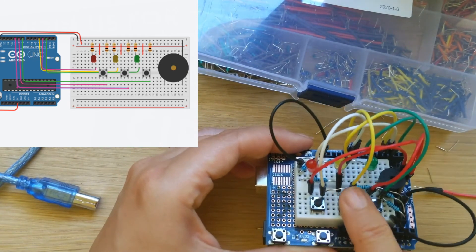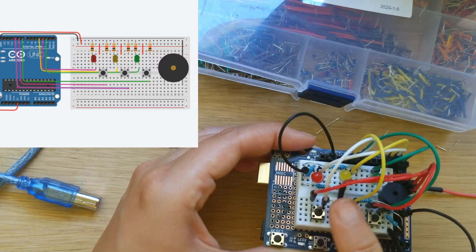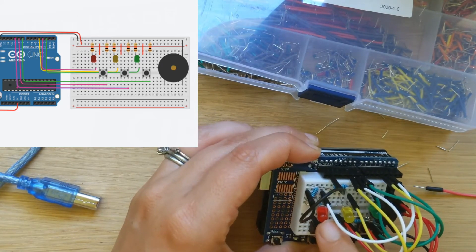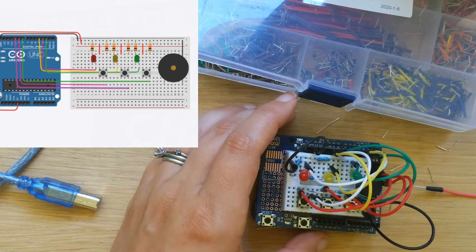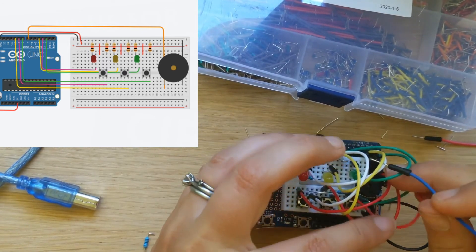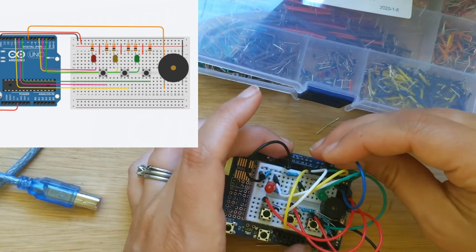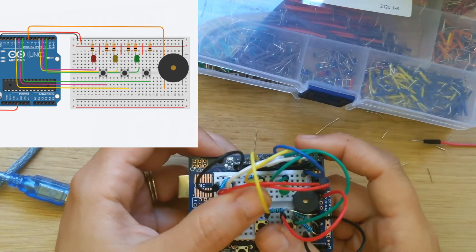So I've got the red, yellow, and green wires all going into the right-hand side of those button terminals, which is also where the little resistors are going. Then I have the red wires from the five volts going into the left-hand side of those buttons. I've got ground going into the piezo. The last thing we have left is to plug in our piezo buzzer signal wire. I'm going to plug that in with blue — you go from the top of your piezo buzzer, plugging into that column, and our piezo goes into pin 7. That is all the wiring that we need to do for this memory game.